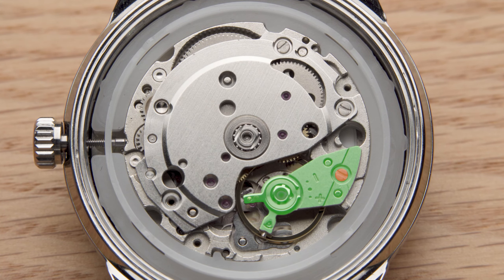Okay, let's start. Remember from another video that hygiene is important. So I'll clean the screw with Rodico first, then put it onto the bluing tray. Heat it slowly and evenly, and then quench it when the right colour is reached. Then I'll put it back to the movement and start with the next one.